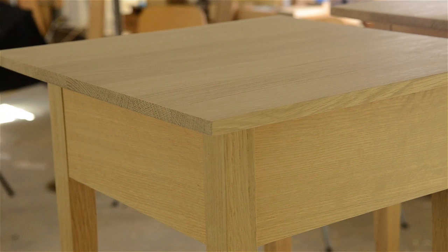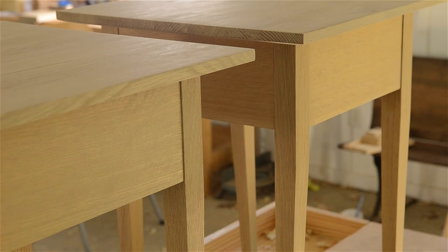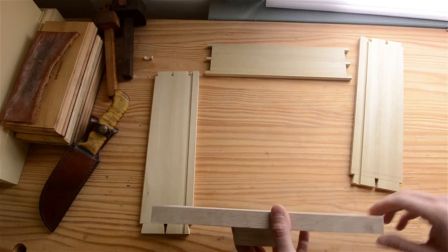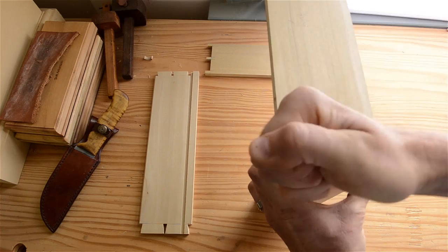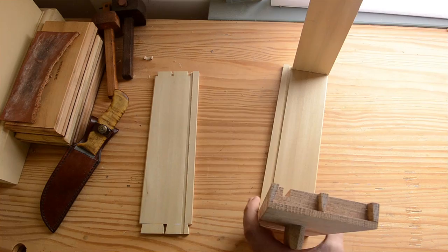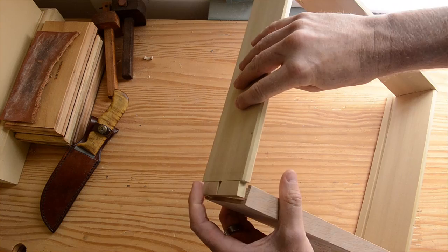Here's what it looks like with the table top on. I actually think that a sign of craftsmanship is to use a thicker table top and bevel the top, which I do with a hand plane. For the drawers: there's a drawer front and drawer sides with grooves plowed into them to allow the drawer bottom. We use a half-blind dovetail to hold the drawer sides into the drawer front, and then there's a drawer back which uses through dovetails. It's shorter so that the drawer can hang out the back to allow for expansion. I like to put the side, then the back, then the other side — that's just how it fits in better.